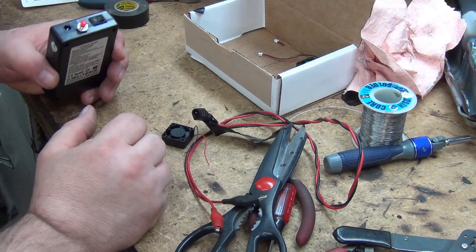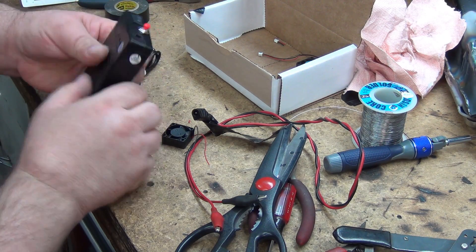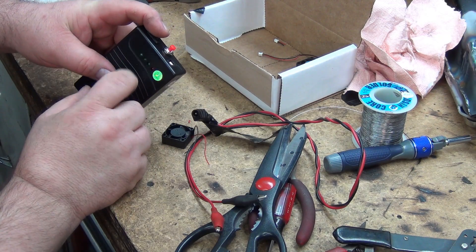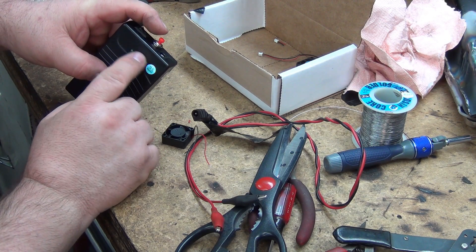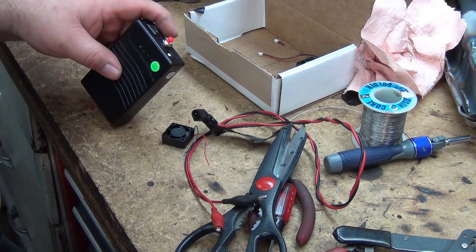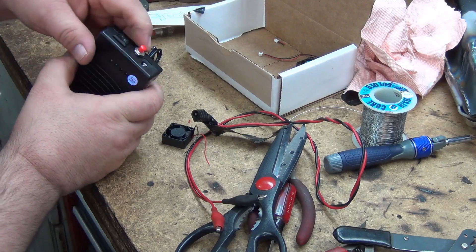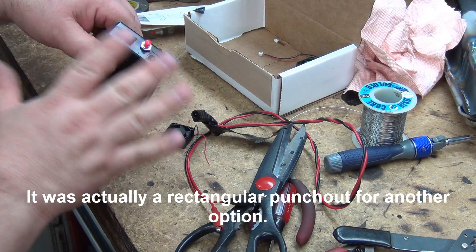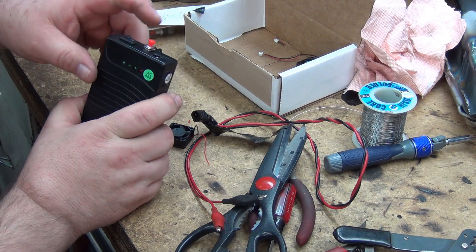What I did next is rather poorly executed so I'm not going to bother showing it, but there are four screws, you can take it apart. I read online — and I saw this — that the lights were on constantly as soon as you turn the power on, which means the LEDs would sit there and drain some of the juice. Not a great deal, but it would cut the longevity. Somebody was talking about putting in a momentary switch. It turns out I had some, and they were just small enough. There was a hole here — it broke out in shipping — so this isn't in there extremely well. It's a poor execution, and if this ever fails I may get another one to do a better job.